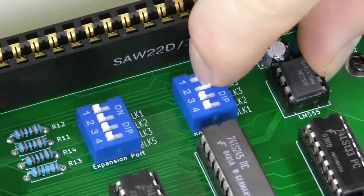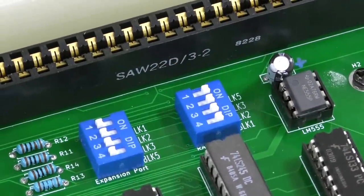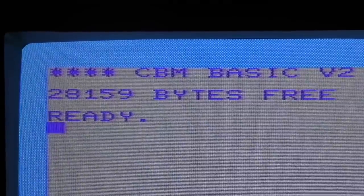And as I mentioned earlier with the VIC-20, you will definitely need to be changing the RAM configuration often, depending on what software you want to run. However, another way around that is to also use the penultimate cartridge as your RAM expander, since it is configurable with on-screen controls. Of course, this totally defeats the purpose of having the extra RAM on the motherboard in the first place.